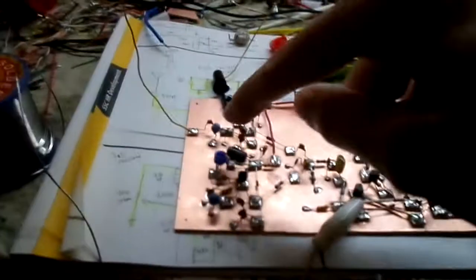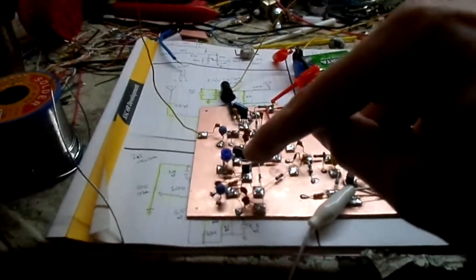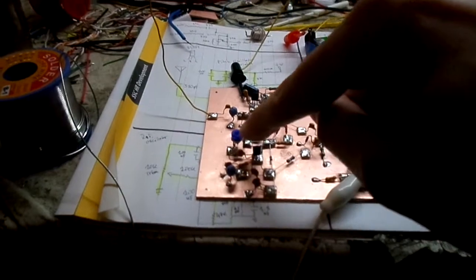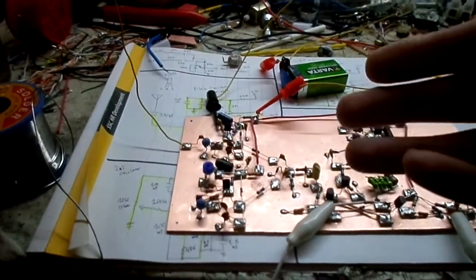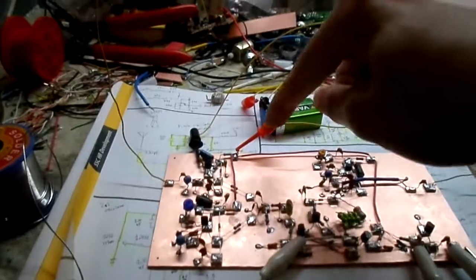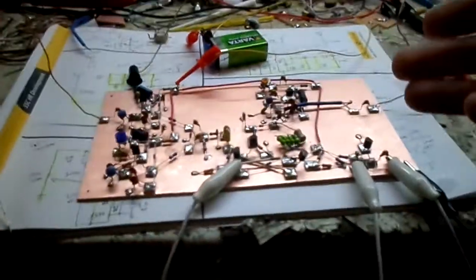So anyway, we have your pitch oscillator, and this is a reference oscillator. This is set at a fixed frequency via this potentiometer. The potentiometer is also here. Depending on what voltage you're going to run this at, I think you can run this at maybe the lowest 5 volts. I haven't tested it yet. I'm running it off a 9-volt battery right now, rechargeable. You can run this off 12 volts as well.